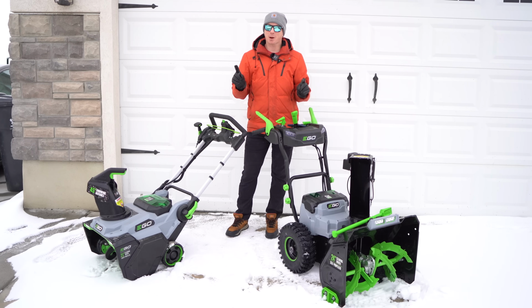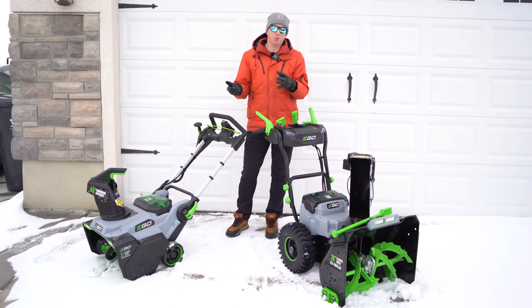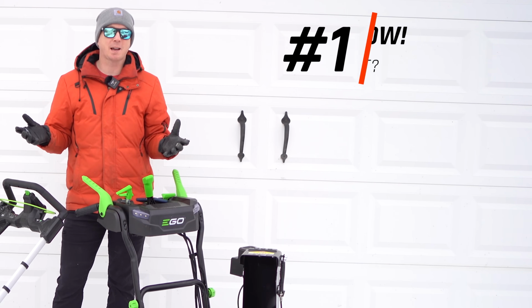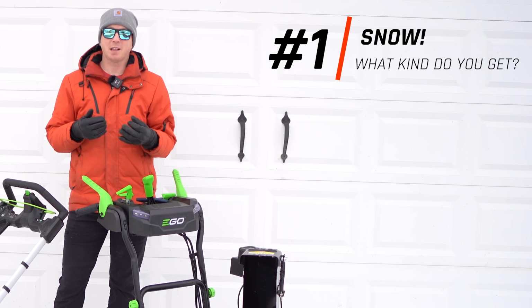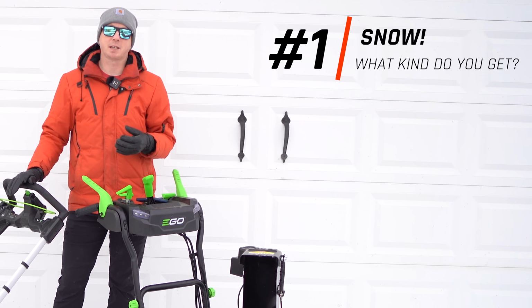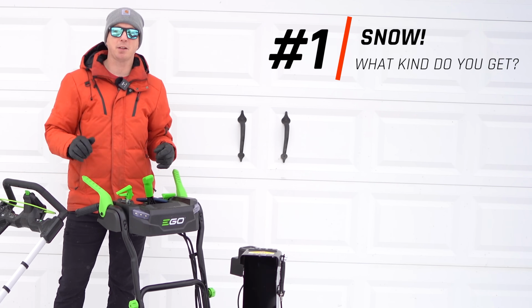Now before I get to our number 1 difference, I have to point out that which snowblower you go with, whether it's a single stage or a 2-stage or even a shovel or a 3-stage snowblower, really depends on a few different things. Number 1 is what is the type of snow that you're getting in your area. If you're getting tons of snow, but it's fairly light, then maybe you can get away with the single stage. But if it's heavy, wet snow, you're really gonna wanna get a 2-stage because that impeller will make all the difference.